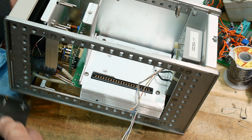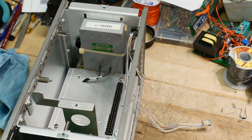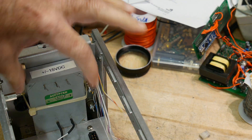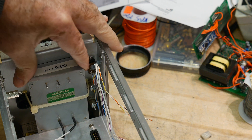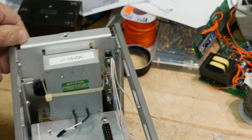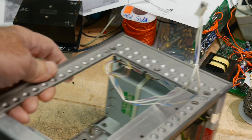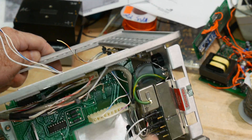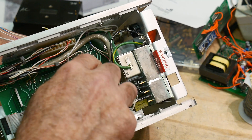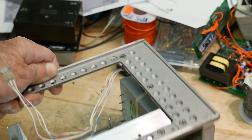It's a little bit smaller than that big switching power supply. What I've done is kind of tucked it in the back here and put a cable tie around it, so it's nice and firm. The AC comes off those two wires there, and I put a hole in the chassis — it comes out here to the AC connector, so it's all wired up. I'm all set to go. I've got a new power supply, I didn't have to do anything — I just bolted it in and away it went. So that's gonna work out great.